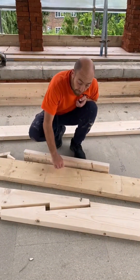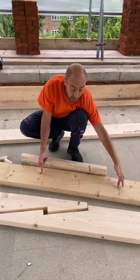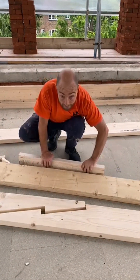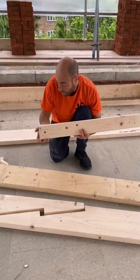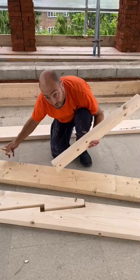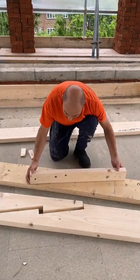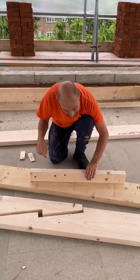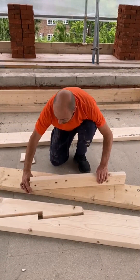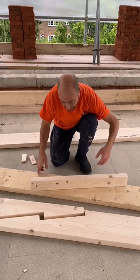This is how I do it. The width times three. So we've got 220 on the width, so we've got 660 long — square through. So that's 9 inches, 27 inches long. Once I've squared that through, I'll find a piece of timber the same size as my wedges, usually a bit of 4x2 offcut, and put that on the edge. It's always from the square line in — the same on the other side, so it always works inward.